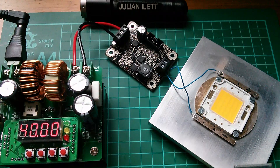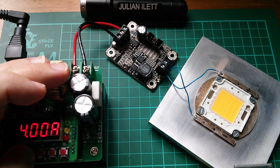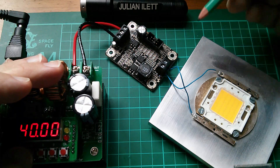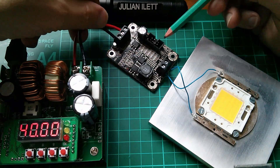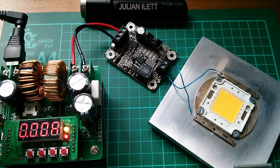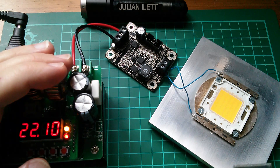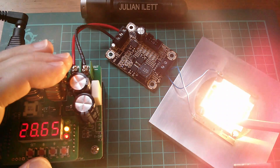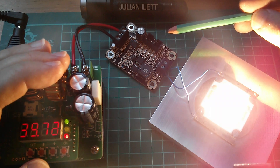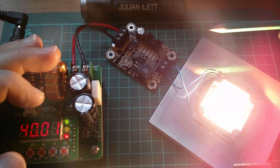So let's just do a quick test. I've got 12 volts coming in here going to my boost converter. That's set to 40 volts and 4 amps, so I'm basically just using this as a 40 volt power supply. 50 watt LED here on a piece of metal, and I've linked the LED driver board for just a link on pin 2, which is 600 milliamps. This thing is just ever so slow to ramp the voltage up. This LED won't start doing anything until about 25 volts. And then when it gets to a certain point, this regulator obviously kicks in - still rising up to 40 volts, but regulating the voltage down to about 33 and current limiting it to 600 milliamps.